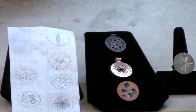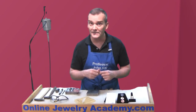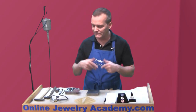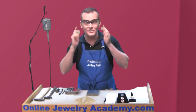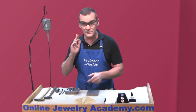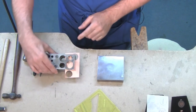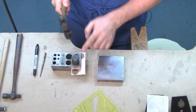I wanted to develop very logical steps in order to be able to fabricate this piece. In this video, I'm not going to show you how to solder things together because that was done in the other video — I just want to focus on this top. The first thing I did was apply my safety glasses, because you always want to work safely in your studio. Accidents can happen quickly, so be prepared. So I took a piece of 22-gauge sheet copper, put it into my disc cutter, closed that down, used the largest disc cutter I had, and with a heavy hammer just punched it out.